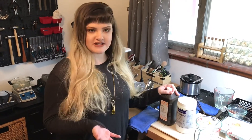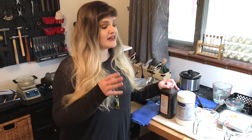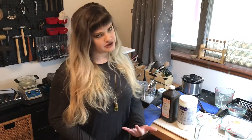You might not even know what that is, so let me first start with: when you work on a brass piece and you flame it with your torch, you might notice it starts to take on a bit of a copper color. Then you put it in your pickle and it gets even worse. You pull it out and the whole thing is copper and you have no idea how you're going to fix it. I want to tell you first how it happens and then what you can do about it.